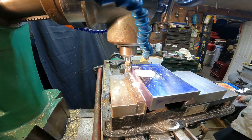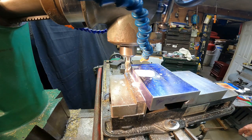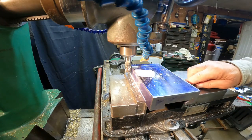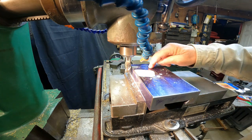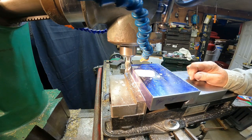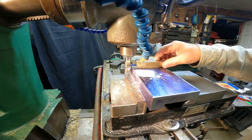So we're going to be turning at 685 RPMs. We're going to be running at full depth, 640 on the depth. We're going to go all the way across. Then we're going to put in the finishing end mill and take care of both edges till we make up the 3/4, which is going to hold a tool cutter.